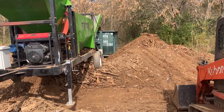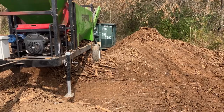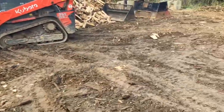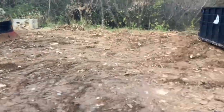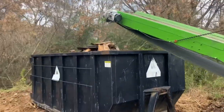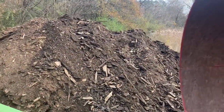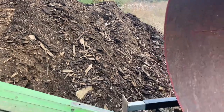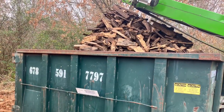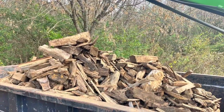We're actually piling the organic material and going to use a Centerlion soil screener to pull all the good dirt out of it. There's a lot of good dirt mixed with sawdust and organic material in that topsoil — that'll be another video with a different machine to clean that. So here we go: about 200 yards of reject material that was a liability converted into about three dumpster loads — that's the third one, 45 yards, about eight cords of firewood reclaimed worth about $2,000 — and we have a pile of about 150 cubic yards of dirt, which we'll run through our soil screener in a separate video.